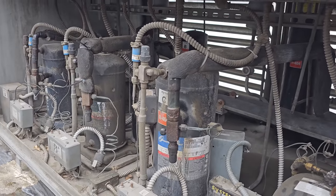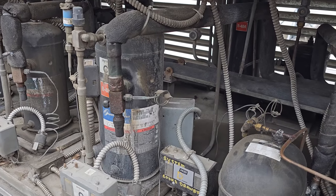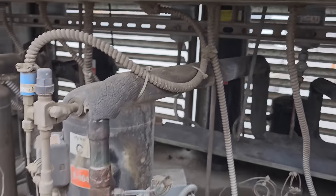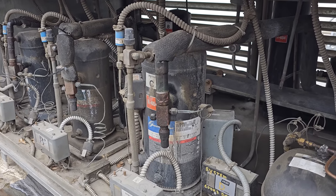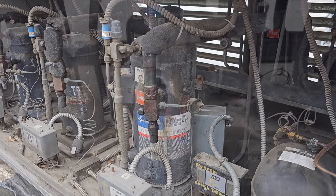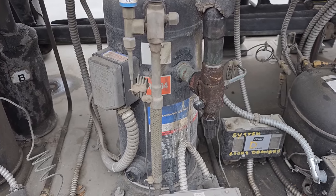I've got another technician picking it up from the supply house, and then we're gonna get it swapped out. Now this thing's never really been worked on. They've been very fortunate. I think we've de-iced the evaporator coils, but I don't think we've ever done any refrigerant or related issues. So since this unit's still running, we can go about it kind of differently.